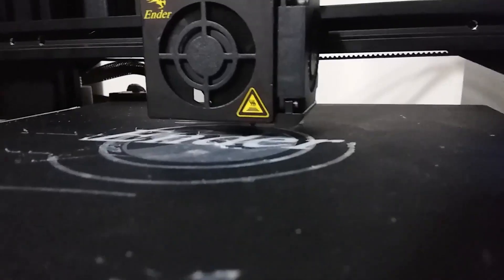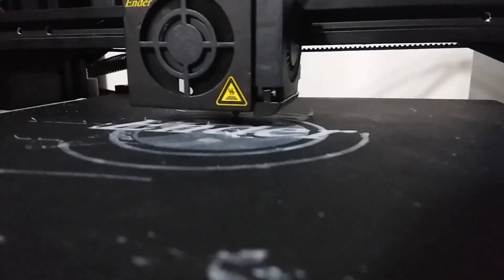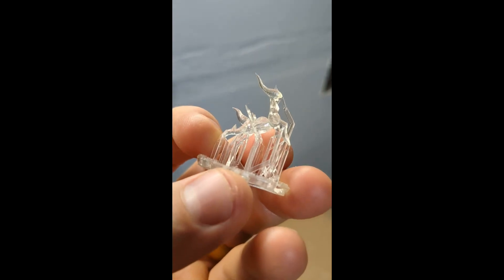I have some experience with fused deposition modeling FDM printers — this is the robot army, from back when I ran a 3D print farm out of my basement. The way these work is basically like a hot glue gun; they have to trace out the entire area for every single print. However, this printer from Formlabs is an SLA printer. It has an LCD screen at the bottom that cures a UV-sensitive resin, which means you can print a whole bunch of pieces or just one in the exact same amount of time — an entire layer cures all at once. It's blazing fast.